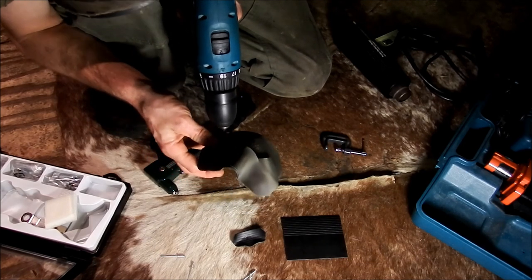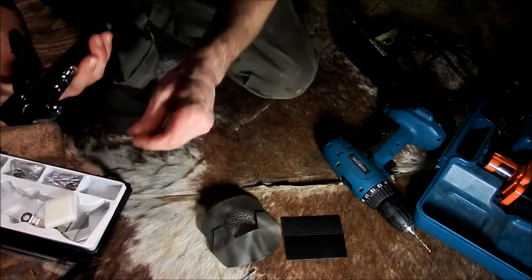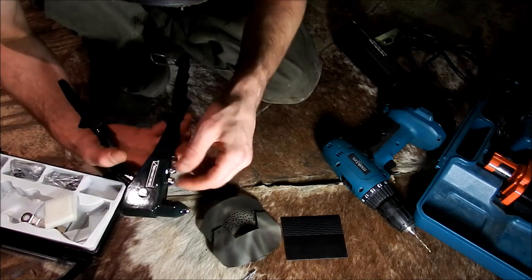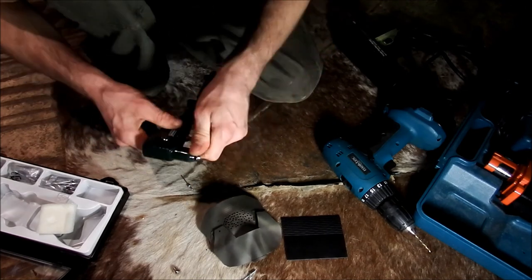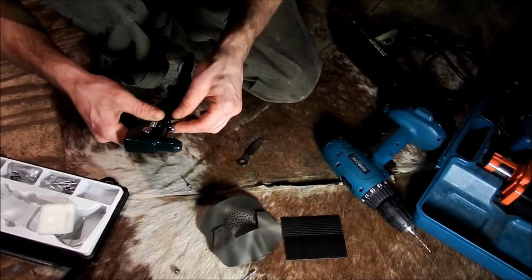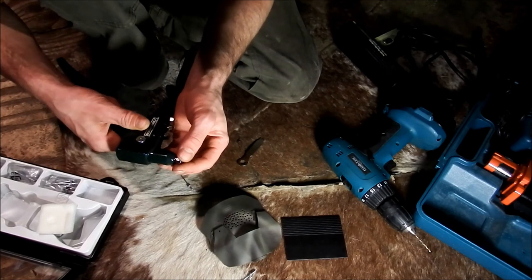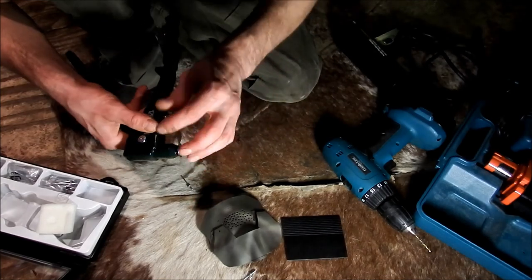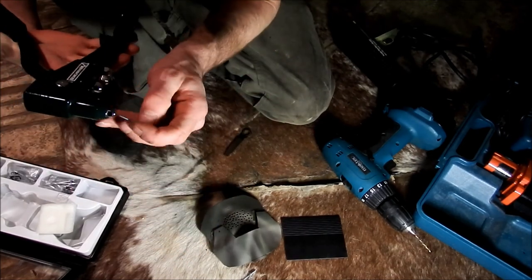I'm drilling my first hole for my first rivet. Once I get it roughly in, it'll be a lot easier to get the other rivets. For those who don't know how to use a rivet tool, you'll want this adapter here — not the bigger one. This is the tube that holds your rivet. When you put your clamp on there, you can grab it and pull it through, and that's how you set your rivets. Put that in all the way, like so.